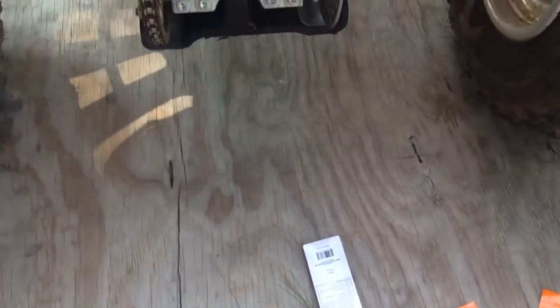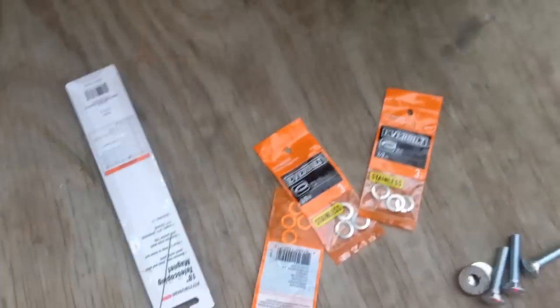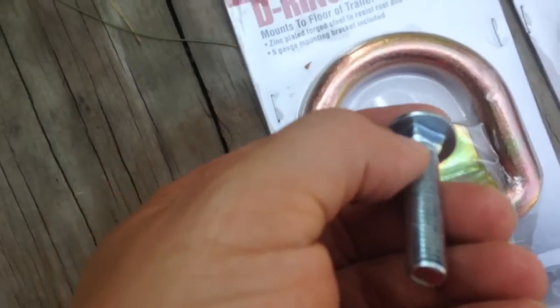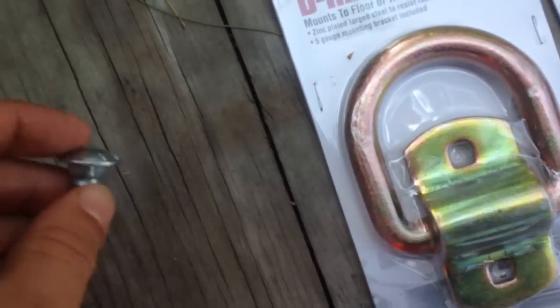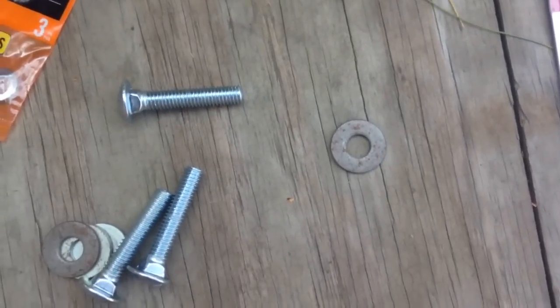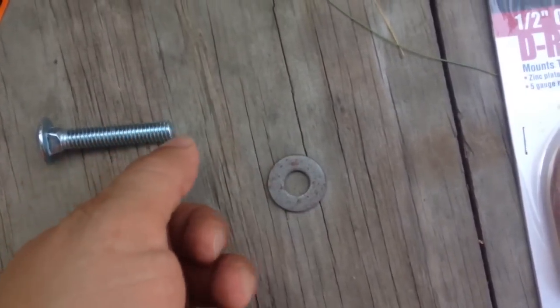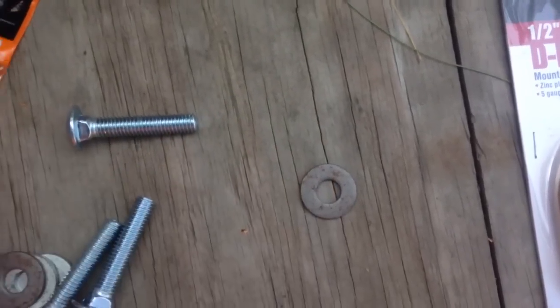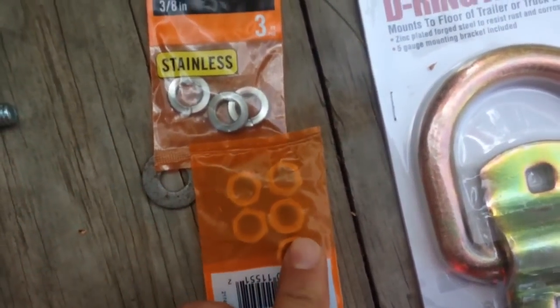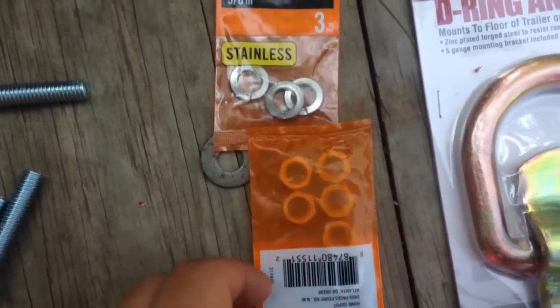In the back we're going to do the same — we're going to create anchor points on both sides since we have two machines, so we're going to put two anchors in right through the wood. I bought four carriage bolts that go through the holes in the anchors. You can notice there's a square part that will fit right in the square hole. When drilling through wood, get yourself some good-sized washers to prevent the bolts from ripping through the wood — make sure there's enough meat on them. Get some lock washers, and you're going to want to get a package of nuts to secure everything down properly.